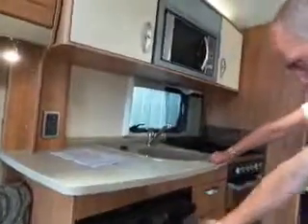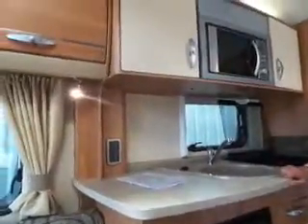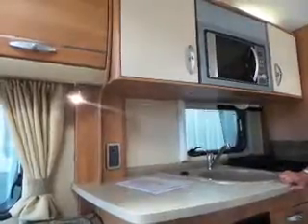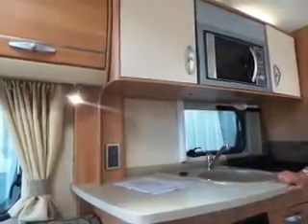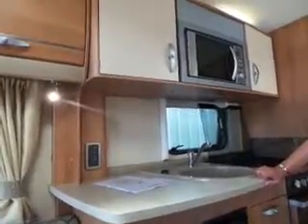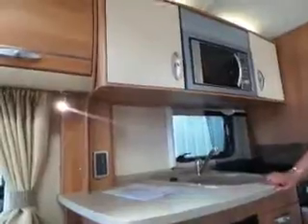Your fridge - that's the on/off button, press and hold to switch it on and off. It's operating on gas at the moment. Press any button to light the screen up - you can see the flame icon showing it's on gas. Press the left-hand button and that changes the energy source so it's now running on electric. It runs on both gas and electric.